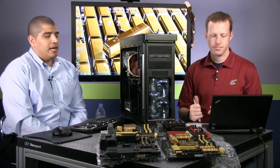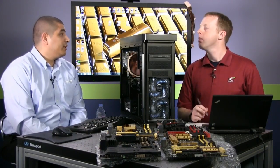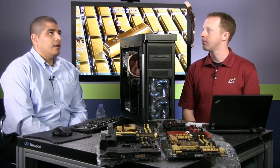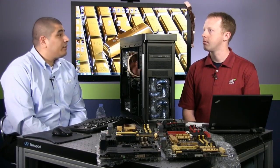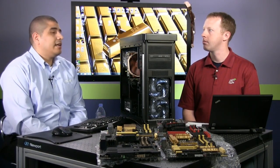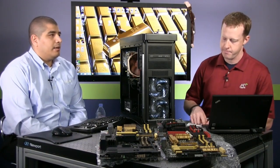It definitely has that vibe because, for us, we'd already been using a digital PWM controller on the motherboard for a lot of generations. So a lot of the inherent advantages of what the FIVR would bring to the table are something we had already been working with for a long time. But for other companies that may not have integrated that, inadvertently they're improving their product because they're adding more functionality, more control, more aspects of adjustment, and better efficiency.